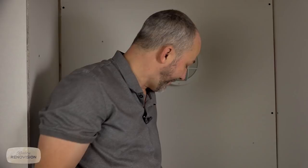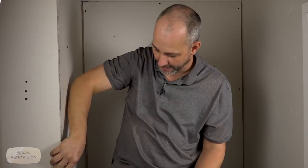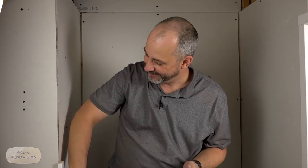Now that we're done the trim on the doors and the windows, I'm going to show you here — I built a little ledge. This is just a piece of one-by-three with a piece of casing nailed together and stuck in there. I think it'll function really well — it'd be nice to give them a little bit of a 'this is where the chalk goes' kind of attitude. Everything has a place and a place for everything, right? And then we're going to use one-by-twos and continue on with this whole New England style corner wrapping and nail everything together. Because it's just a playroom, we're not going to get carried away with puttying all the holes and painting all the trims — we'll try to keep it somewhat simple but nice and clean and tidy.